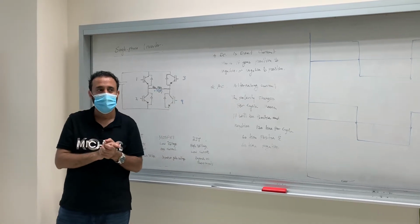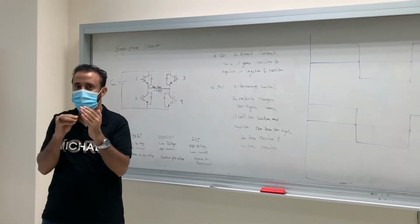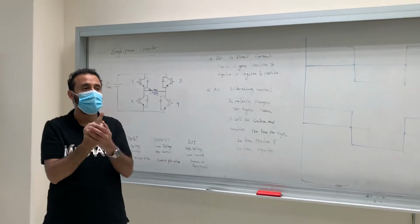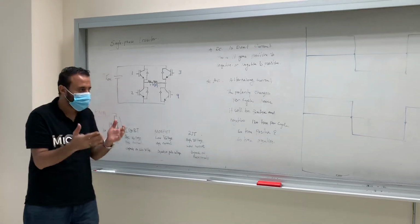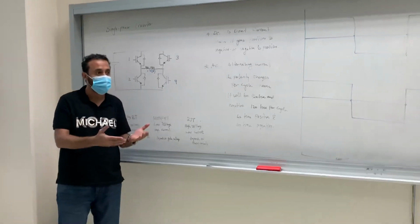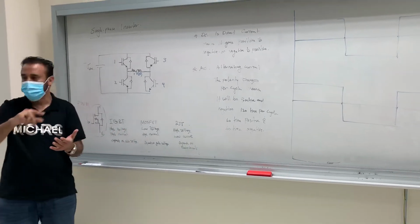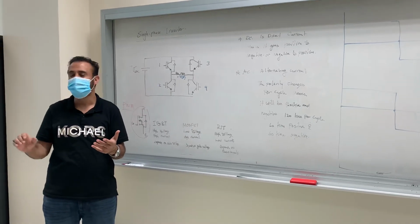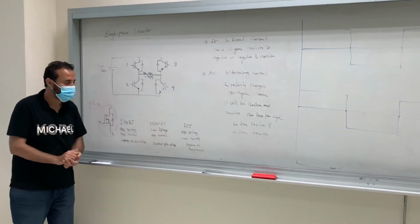is small. One of the groups applied high voltage in boost. They applied 120 volts and the duty cycle was high, and one of the transistors was burned because it cannot handle it. The range for Mosfet is less than 1000 volt. Imagine in boost, what's the equation? V out equals V source over 1 minus duty cycle. If the duty cycle is 95 percent and the source is 120, 120 divided by 0.05, how much? It's over 2000, so that's huge voltage, and this will be burned.